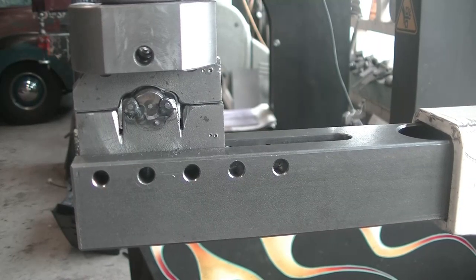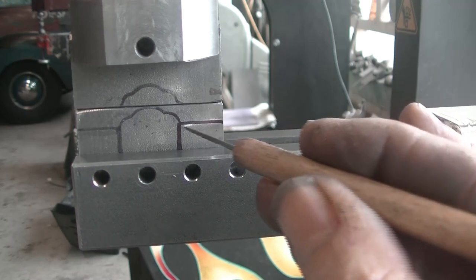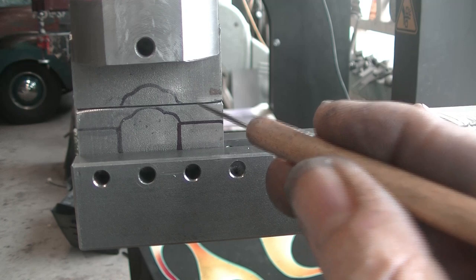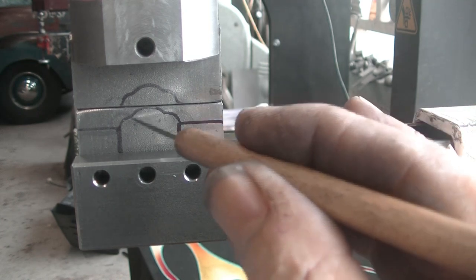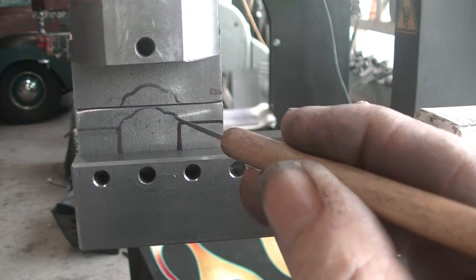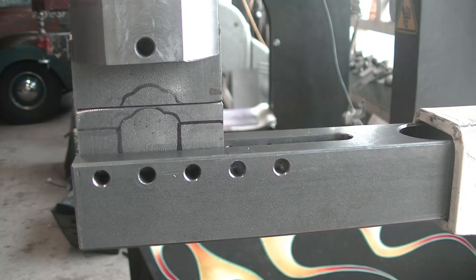This shows the dies I made for the profile. When you cut to the line, it will act as a fence because the upper die will hit it. If you leave enough clearance in the profile, like 0.5 mm, it won't stretch the piece you run through it.